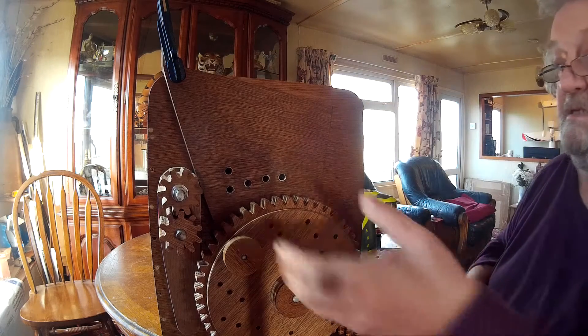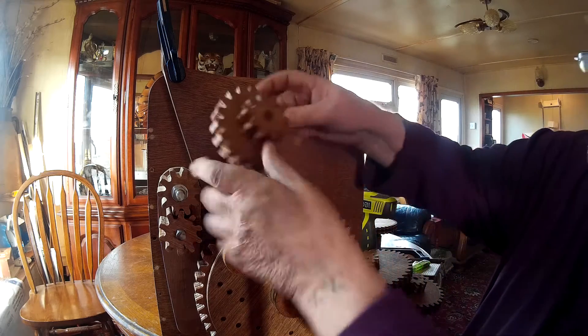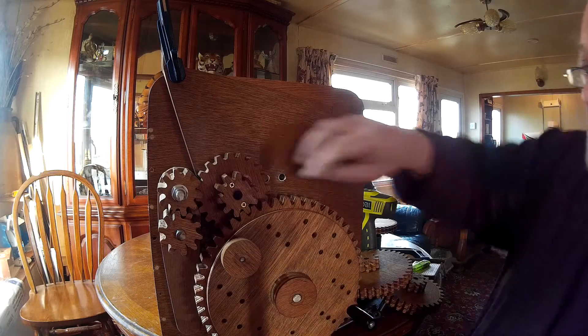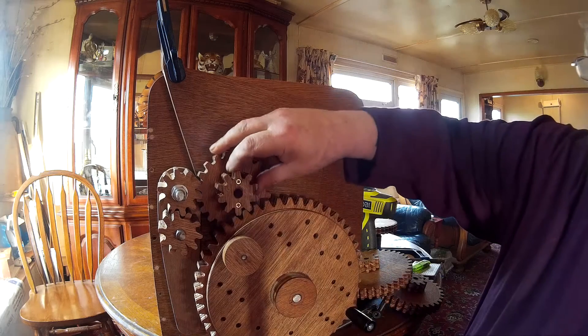You try all your gears on, and obviously they should fit. You'll probably get the occasional tooth which just catches as it goes around — individual teeth. Make a note of which one, take the gear off, file it a little bit, and put it back on.